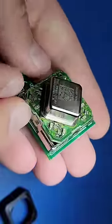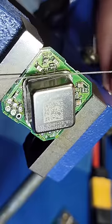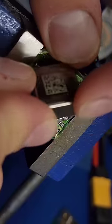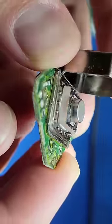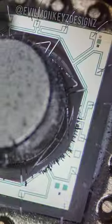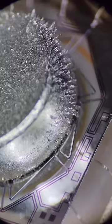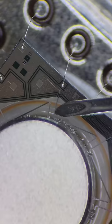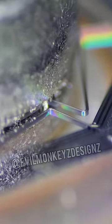Let's take a closer look at another MEMS device — a gyroscope from 1998. Specifically, this is a vibrating structure gyroscope from Silicon Sensing. What's inside this device is actually quite surprising. The actual MEMS part is the silicon ring structure that sits on top of a glass block, consisting of a 6mm diameter ring connected to 8 asymmetric legs. As far as I understand, these 8 legs are transducers, and among them are driving and sensing elements.